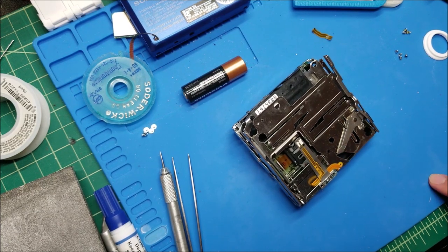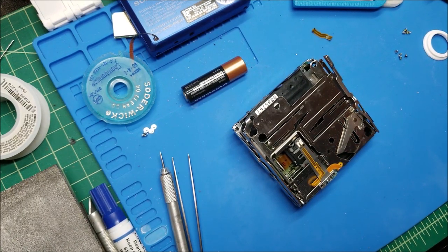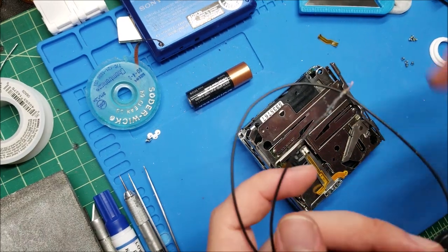What I ended up using was a sharp, short exacto blade. I leaned my finger against the side and scraped lightly over and over - the insulative part just flaked off. I only did two little spots - if you go crazy you go right through the copper and have to cut back and start again. I put a little flux and pre-tinned them so they're ready to accept new wiring. For the wire itself, I have solid core but long term as you open and close the door it'll create a stress fracture. Ideally I want enamel-coated multi-stranded wire like used in flexible headphone cords.